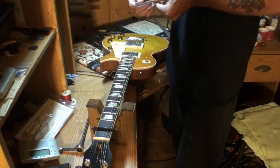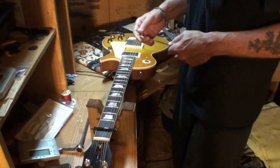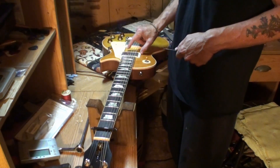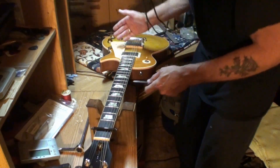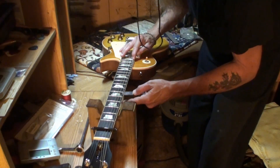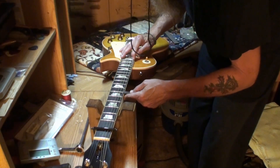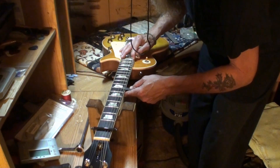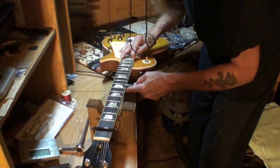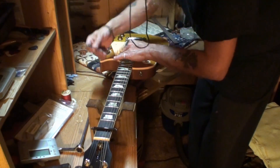Just now, all I did was tighten it about a quarter of a turn and tighten the strings back up. It's in tune now — I've got a capo on the first fret. Already it sounds like it rings out better. Coming down to the 20th fret, checking at the 7th — we've got 12-thousandths neck relief. Yes. It's a little bit tight here on the 9th fret, gets a little tighter on the 10th, but that's just rust on my feeler gauge — it's 12-thousandths. The 10th fret is a little tight, but the rest are good.